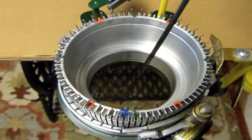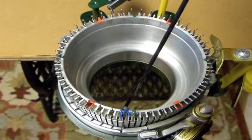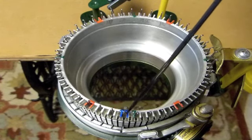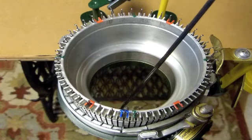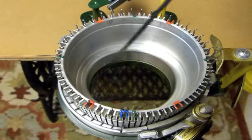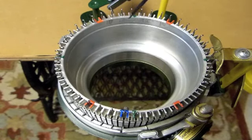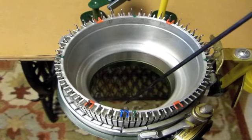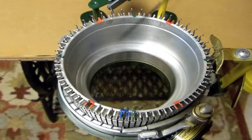I also want to point out this little rod down here — this is your cylinder pin. I have marked the placement of the cylinder pin here in blue. This cylinder can be mounted with the cylinder pin either in the front or the back of the machine. I choose to mount mine at the front because I form my heels on the back of the machine.